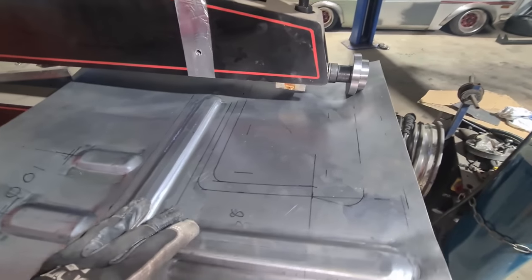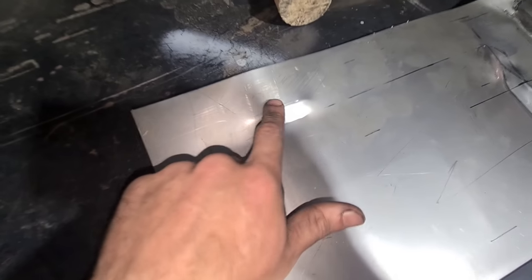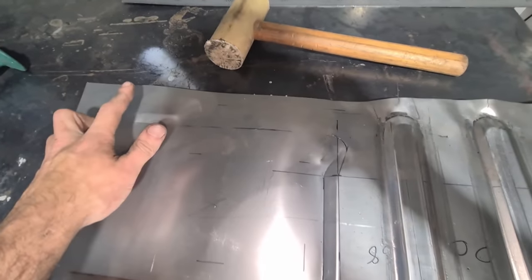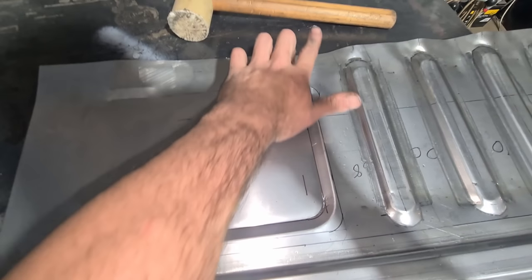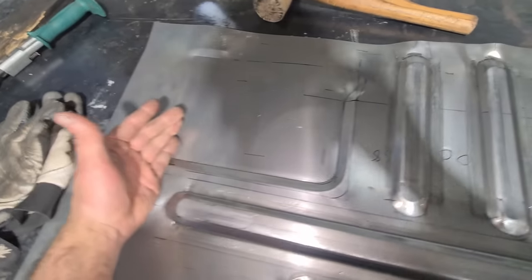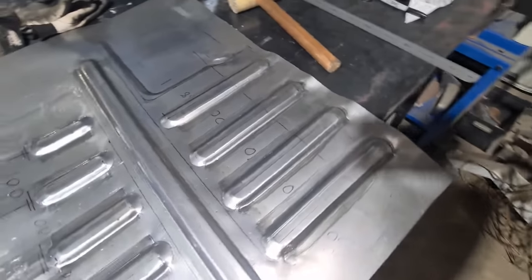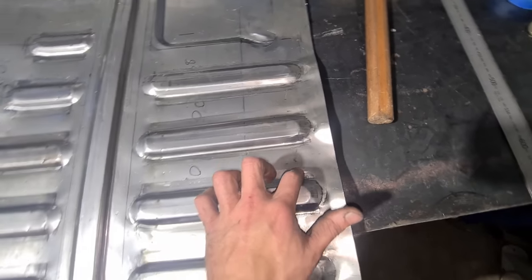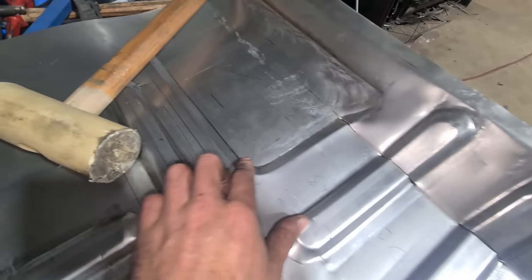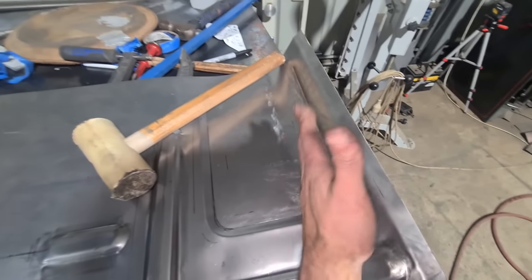Test piece — 15 mil drop for the bead roller, got to taper off to nothing because the firewall flange sits on that, taper it off from nothing, start it, and it's got to roll right up on this flange too and taper this way. Pretty tricky show. Not going to do any more test pieces though — just going to run it. Yeah, run that, tape it off for the 45, then blend it off to nothing where the rail sits over the top.